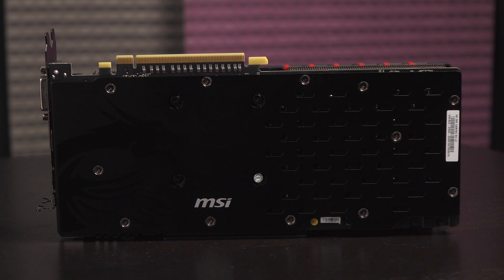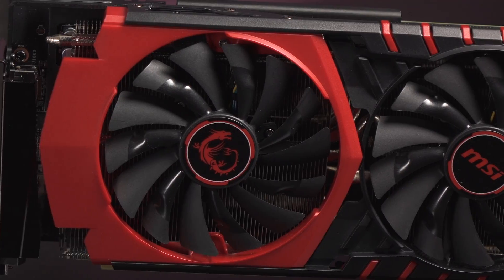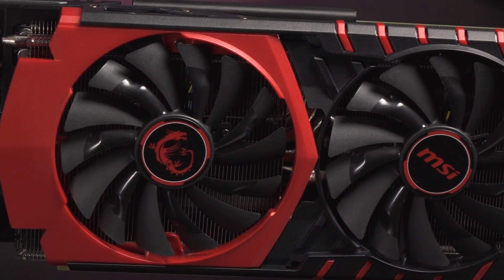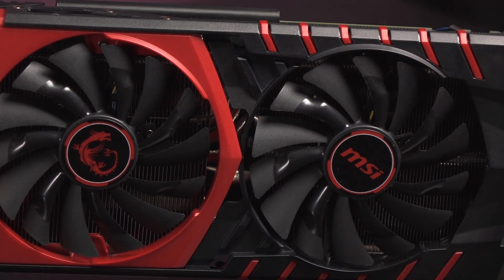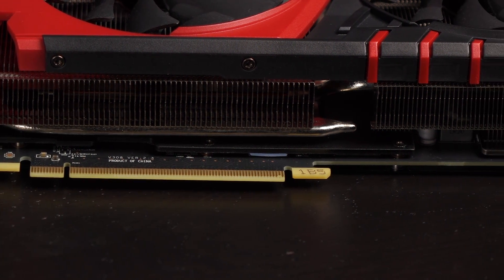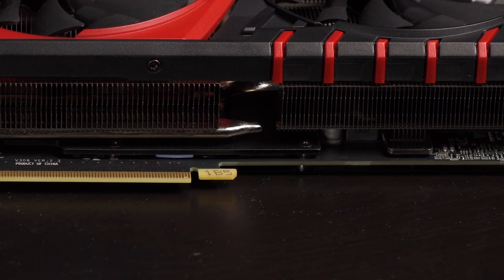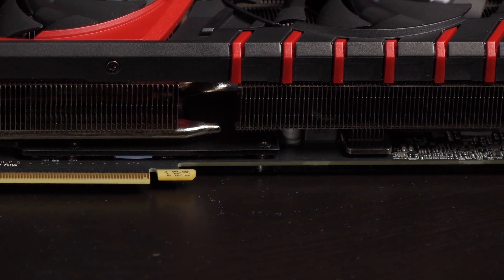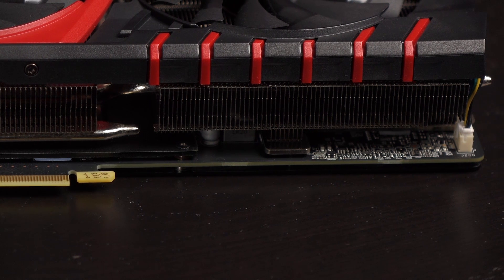On the back of the card is a matte black PCB with a metal backplate for rigidity and to help cool the VRM. This card measures 10.9 inches in length and weighs 2.89 pounds. It comes with a plastic open shroud design in classic MSI red and black colors. You get two 90mm Torx fans for quiet and efficient cooling. MSI uses small deflectors on the aluminum heatsink to guide more airflow onto the heat pipes, and the 8mm nickel-plated copper heat pipes adopt the SU form design that comes in contact with the core and threads through the fins to further improve cooling.